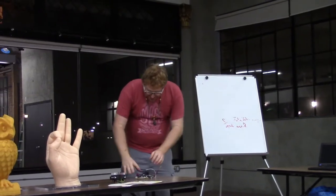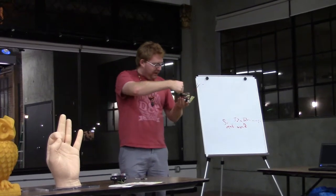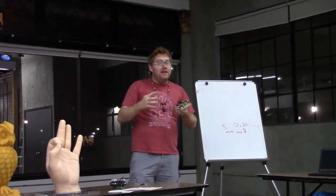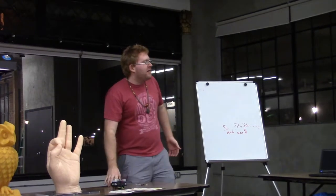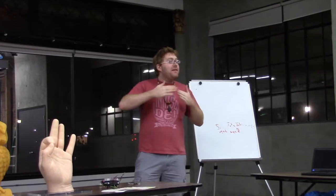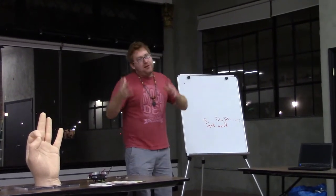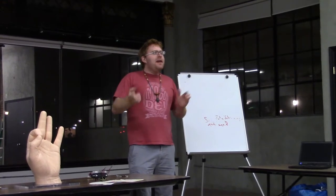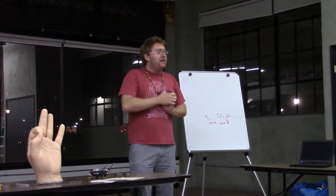So the next piece is actually all of this stuff here. And this is the heart of the circuit. What I found out is that LEDs aren't like standard lights where you just apply a voltage and go. LEDs produce light based on the amount of current running through them. And not only that, but as they heat up and generate light, if you just apply a straight voltage, too much current can go through and you can damage them.